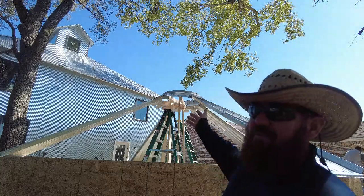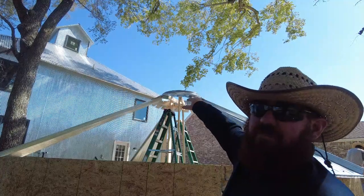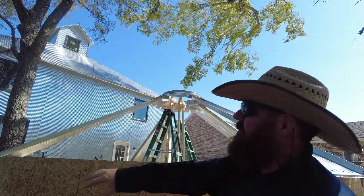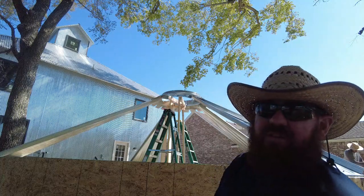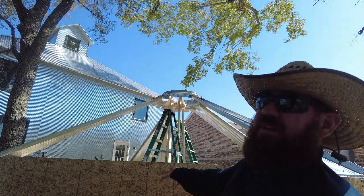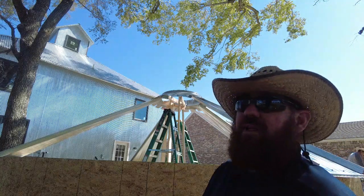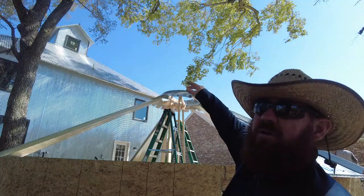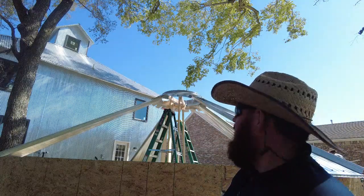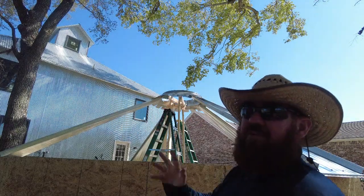If you were using metal, it'd be 3 foot. So you would just build an 8'4" box, set your fill hole on top there, and then you'd be able to drop your panels off to the side of your tin. For our application, this was a 26-inch tall wall, and so we would have just done that. But 5'4" for the 21-foot roof. That's the only one I know, but that's what it is, 5'4".